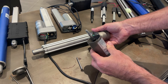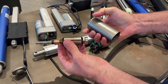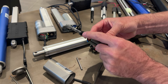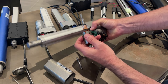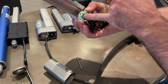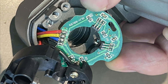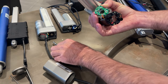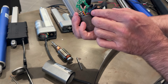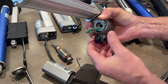Pulling out the armature, you can see inside the motor: two magnets either side, the coil, a big bearing on the back, the commutator, and a magnet on the end of the shaft. When that magnet spins inside the hall sensor PCB, these two sensors - called hall sensors, there are two of them so you can sense direction - count the revolutions. Every revolution of the armature counts one pulse and sends feedback into the controller.